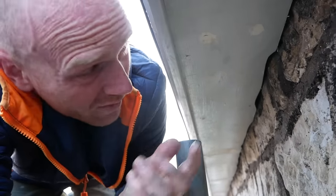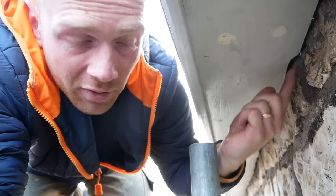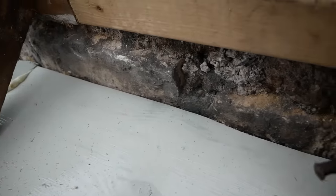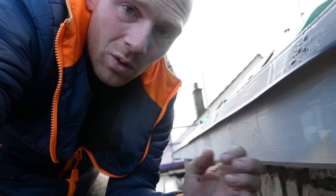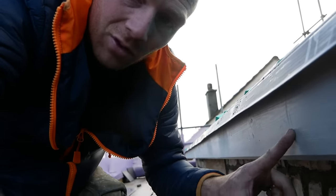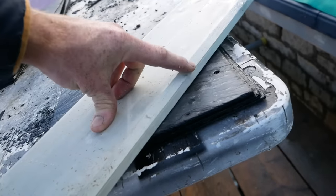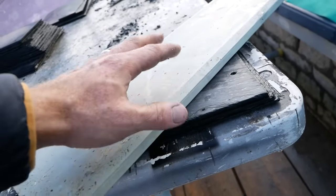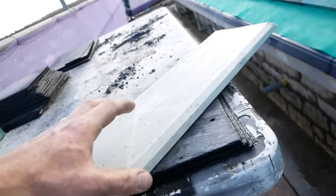Under here you can see I've used a 7 inch soffit — 175mm, probably 170 total — and that's allowed me to scribe it to the stonework. The original one was square with lots of gaps up here, bird-size gaps. I've probably ended up with a 5mm gap all the way along which actually acts pretty much like a nice vent to give a bit of airflow, not that we really need it. That is just secured up to some blocks which are on the rafters, and then on top of that on the front I've added our fascia board. This is a 150mm redwood fascia board. These were all pre-painted down in the workshop but of course I then ended up with a load of screw holes which I've filled, sanded and it's now ready for another coat or two. All I did for the detail is a chamfer on there to match the barge boards. The original fascias had a little bit of a bullnose or ogee moulding going on, but this should at least give a good drip edge. I've also taken the back edge off so there are no sharp corners — this will hold the paint much better.